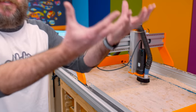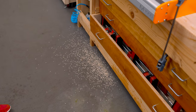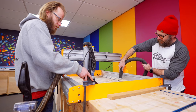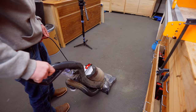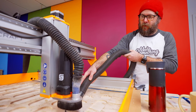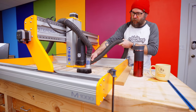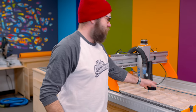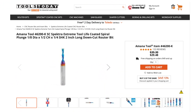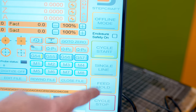The one thing I forgot to do is get my dust collection set correctly — it was up too high, so we just made a mess. We got that first pass all done but the dust collection wasn't doing anything, so Dan and I had to follow it and baby the machine the whole time. Now I'm going to put an eighth-inch bit in there and it's going to do the detail work where the paint drips are going to be, and do one final pass.